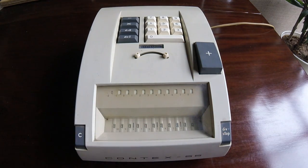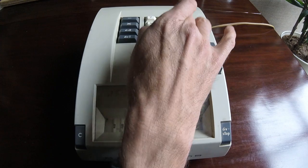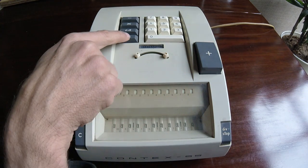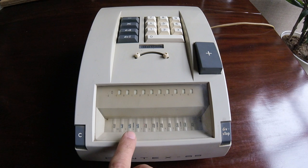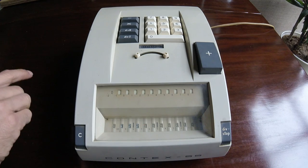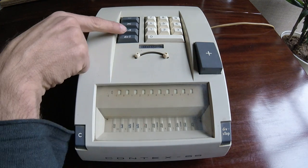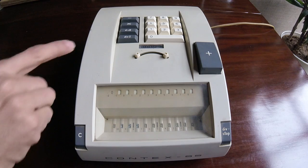I'm going to clear everything and prepare for the last operation: division. For this we are going to do a pi approximation. I have a problem with one of the digits in this machine, so it's not going to be fully accurate. I'm going to input 355 — it is collected on the left-hand side. Now I'm going to divide this number by 113 — 3 digits — and press input. When I press it, it's going to automatically get all the results by using the repetition count over here. Let's hope it works okay.